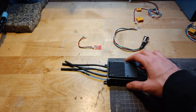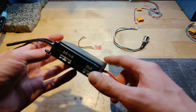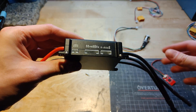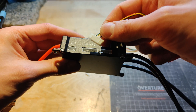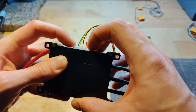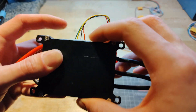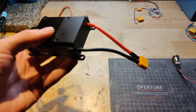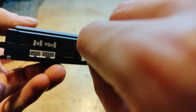Our controller is now compatible with the powertrain of the board. Now we can connect the necessary components in order to get this thing booted. We will start by plugging in the Bluetooth module. This allows connection to the phone and is inserted into the general comms port of the U-Box. Next, we will install the switch. This will toggle the U-Box on and off, as well as provide a debug LED that will flash codes for troubleshooting.